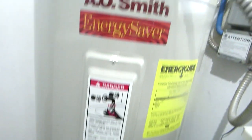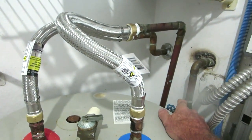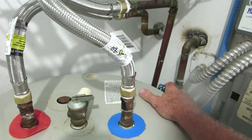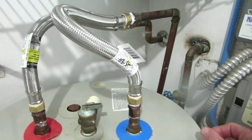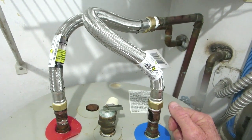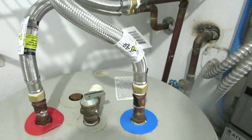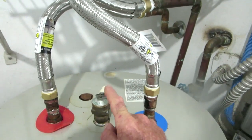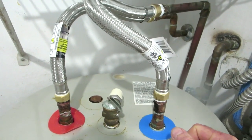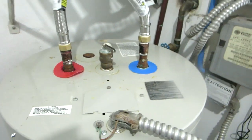As you'll see in my case, opening that little valve did nothing. So what I ended up doing: turn the water off to your water heater - if you have a dedicated water line to your water heater, turn that off, or you may have to turn the water off altogether to keep water from going in. You can try to drain it by popping a relief valve, but if it's not blowing out the bottom with full pressure, I would not mess with that.